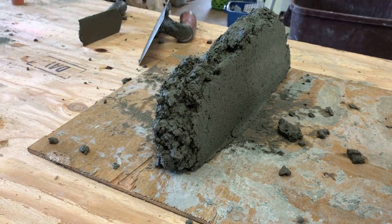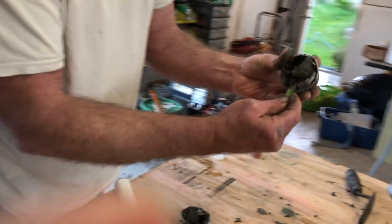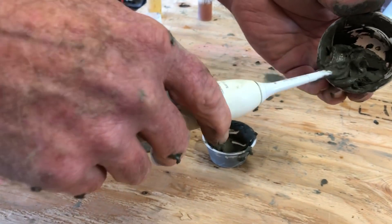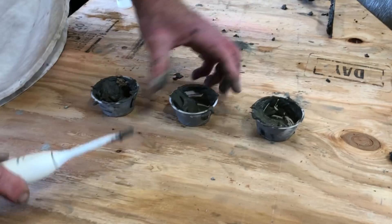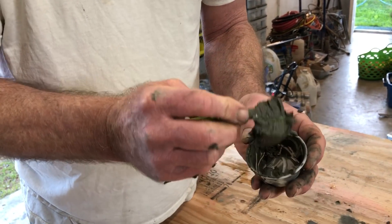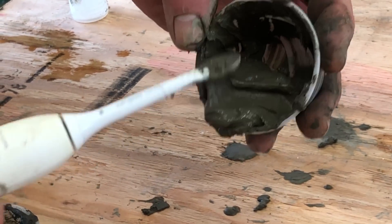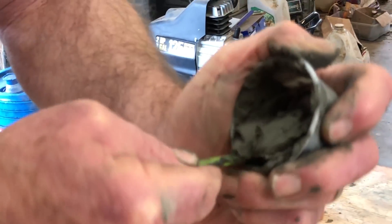So now I want to go back to these guys and see how they're doing. This one is the plain cement, and we can see the effect of this admix now — this is almost like a rubber ball. See how it responds to the vibration. So even though this thing would almost bounce off the tabletop, we can still turn it back into a puddle of water. And this one is the Delvo. The Delvo is going to be a little bit slower and possibly a little bit stickier because we've got less water in it. Same thing — I can get this to go right back down. The Delvo is going to stay softer longer; three hours from now you will notice a little difference in the Delvo and the plain cement. And then here we have the polycarboxyl ether.